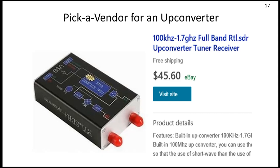For example, the dongle has a 28.8 megahertz clock, and USB ports have a 48 megahertz clock. Multiply 48 times three and it gets into the ham band lower part. You'll need a trap near the antenna for any IF you use. Years ago I recall often hearing a foreign broadcast station rolling in while testing a Motorola portable that had a shortwave frequency right there in the middle of the IF — you could hear foreign broadcast real good on the test bench. In other words, your cheap dongle has a wide barn door that you may want to narrow.